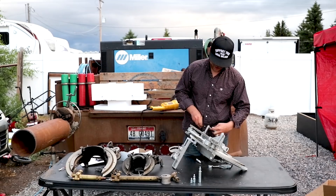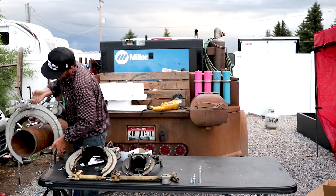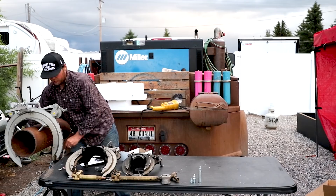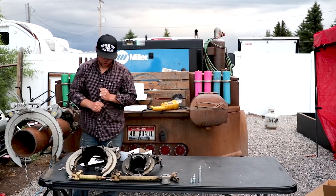This is set up for an 8-inch piece of pipe — we're just going to stick this on here. Most of the time, unless I really trust the helper, I won't let them use a beveler just because of the price on them. They're really expensive but they are worth every penny. Good tension, but not so much that it's just cranking on that.